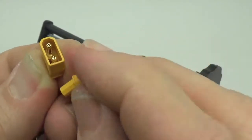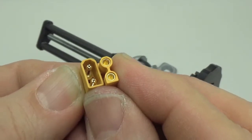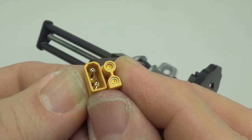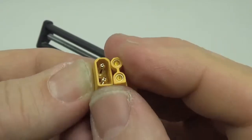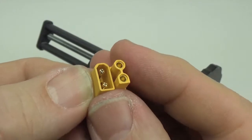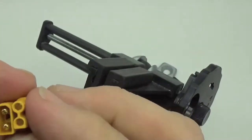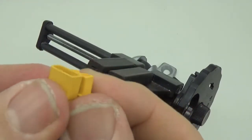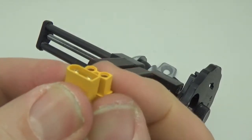And that way, when you put the connector on, it actually increases the amount of friction. And so when these connectors get old, it's really easy to firm them up again just by wedging a very tiny screwdriver into that connector. So I've switched over to these because I found that over time they age more gracefully than some of the other connectors that I was using. And the other thing about putting battery connectors into place, these have really nice covers on them. You can see that it's very hard to have a touchdown on these exposed connectors.